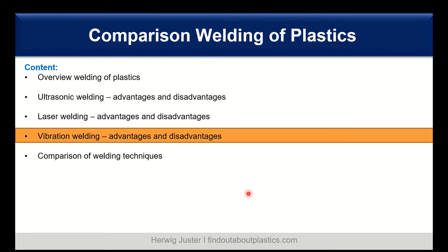Let's continue with vibration welding. Vibration welding in general is the close cousin to ultrasonic welding. However, this technique uses a reciprocating linear motion and not a vertical motion as in ultrasonic. What is the same is that we have a downward pressure to join the two parts. The frequencies are much lower compared to ultrasonic welding — here we range between 100 to 240 Hz — however, the amplitude is larger. With this friction vibration welding, we can also make big part joints and more robust joints as well.